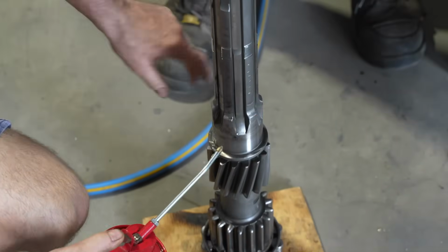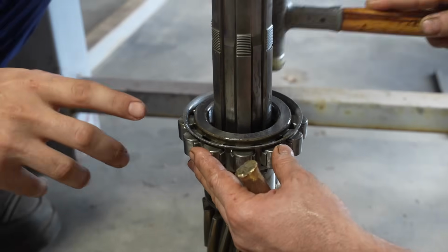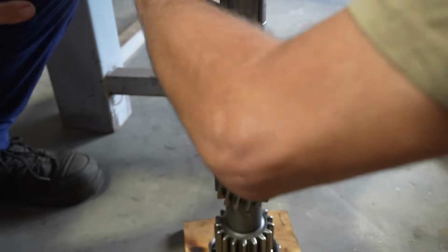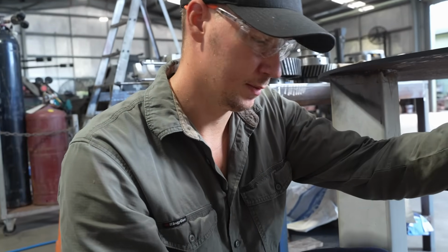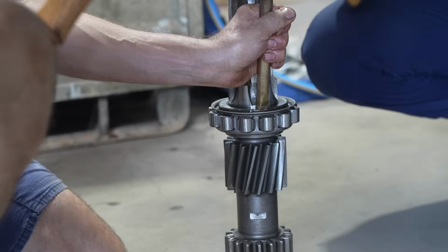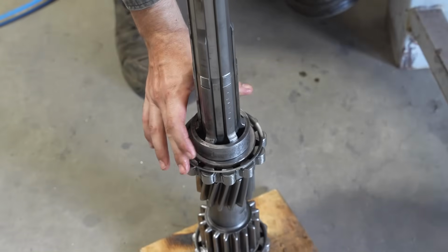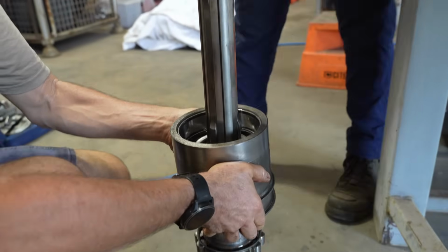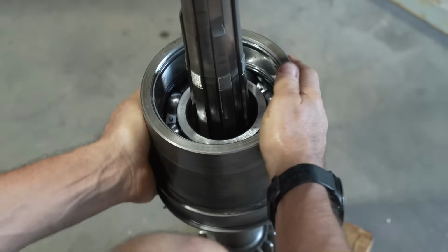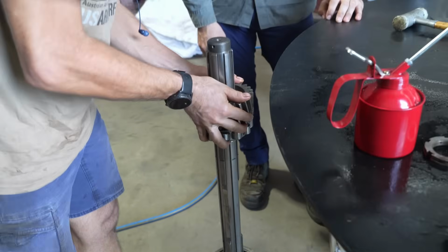After a bit of back and forth, we get a slight change of plan. Taking the bearing in or out of the hub assembly, hitting that on first, and then we're going to put the spacers on, and then put the hub assembly over the top of all of this. The reason for this was that since everything is such a tight fit, it was a lot easier to take the bearing inners out and fit them to the shaft separately, and then slide the outers carefully over them. That's that for precision fit.